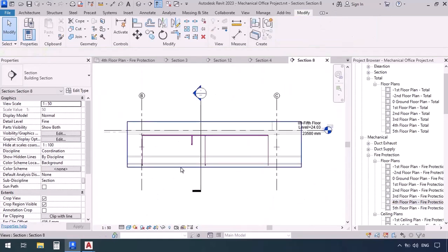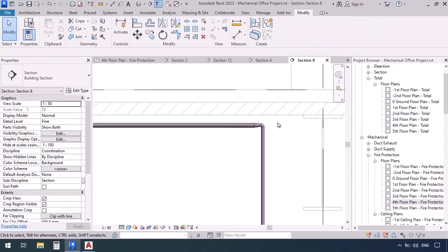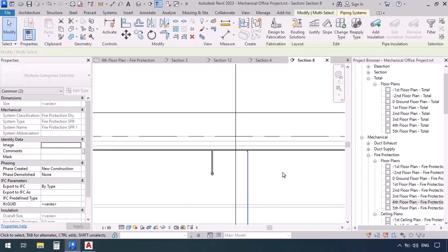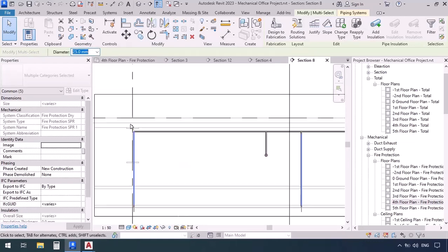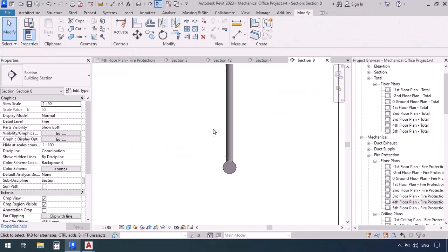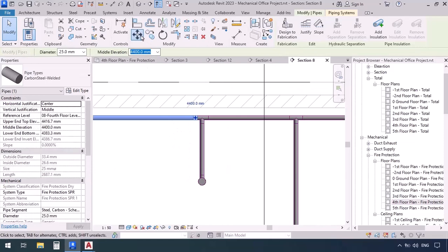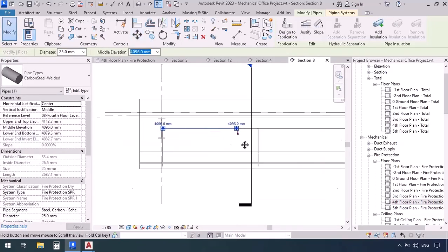Right-click and go to view. Let's take a look here — there's one connection, there's another, and this one. Let's readjust the diameters. I'm going to hold the control key and click on this, and while still holding it, select these two, then change the diameter to 25. So we're done. Let's fix the length of the nipple — currently it's on 404. I'm going to select the pipe and then move it, click somewhere and go downwards, then type in equal 404 minus 100. This just came down and all of those have been fixed.